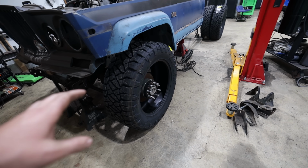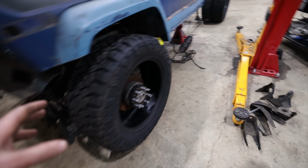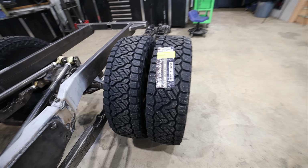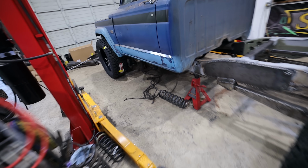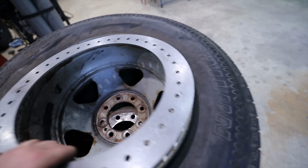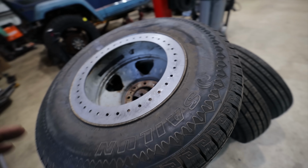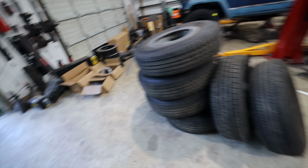It's not going to perform the way that I would like it to if we have to go with a narrow tire up front. I want a fat tire in the front. I want two narrow tires in the back to basically make one crazy wide tire in the back. And I think that this is going to give us the best performance off-road. This thing's heavy. It's going to need some flotation, and so it needs a lot of contact patch to accomplish that. The rear wheels, we're going to do dually beadlocks with these DIY beadlocks. I'm not even sure if any companies make dually beadlocks, but in any case, I've got all these dually wheels that are the right size, and the beadlock kits they're not cheap, but they're cheap enough to make this practical.